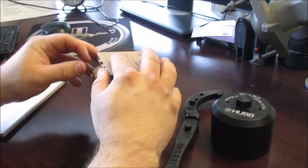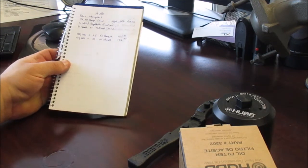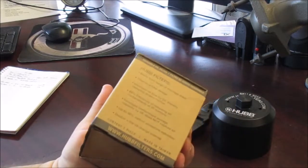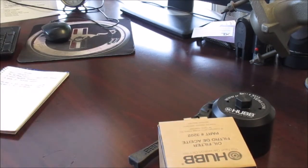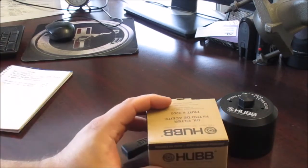On the next part of this video, we're going to be installing this on the police interceptor to show what kind of footprint it leaves. One quick note: at 125,000 miles on a 4,000-mile interval, you're looking at just over 31 oil changes — a cost of $156. When you factor in longevity, using the reusable filter makes sense both to reduce waste and cut cost. Replacement elements are about $56, and you don't need as many elements as you do filters — just enough to handle your PM volume.